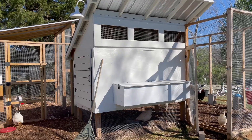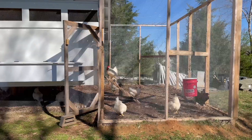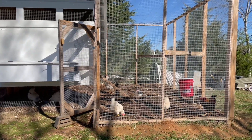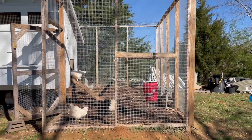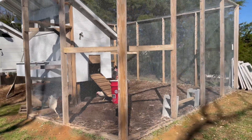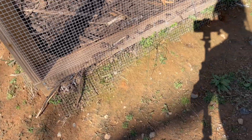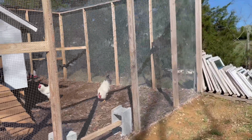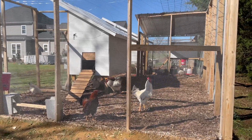That's a really easy way to keep the coop clean, free from smelling, and the eggs are always clean. The runs are made out of two-by-fours framed together like you would frame a wall in a house. They're covered with half-inch hardware cloth, and that hardware cloth is brought down into the ground and then covered up so that predators cannot dig underneath.